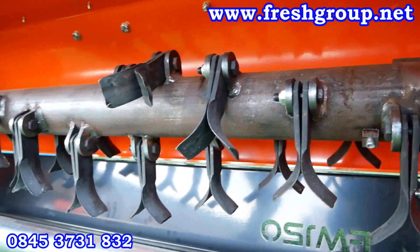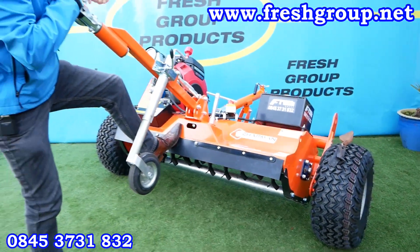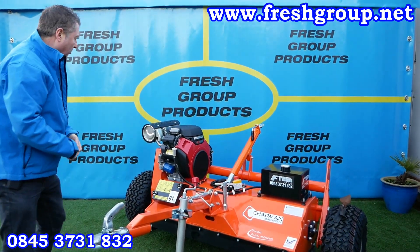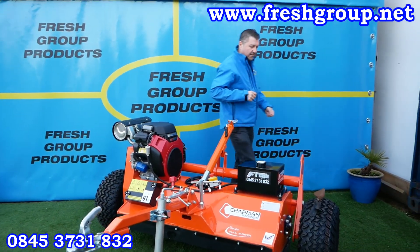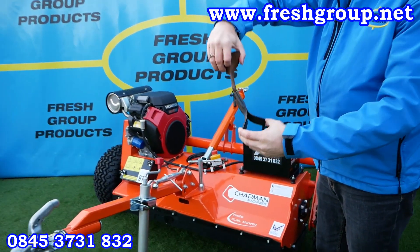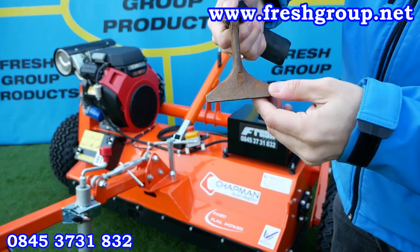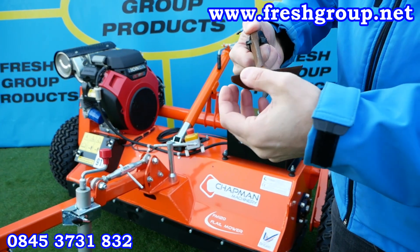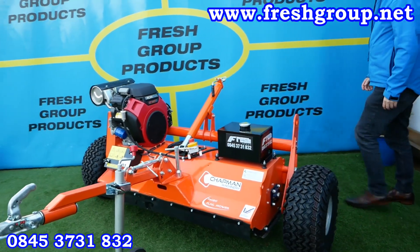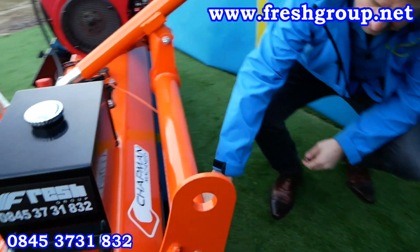The Y-flails are high-density hardened steel — when you're comparing different makes of mowers you'll notice this is very high specification when it comes to the cutting blades. These are the Y-flails, and these are the forged hammer flails which offer more of a cutting edge. If you call us we can advise you on what is the best cutting blade for your specific operation.